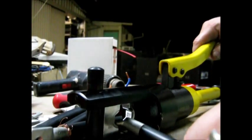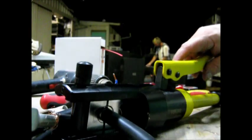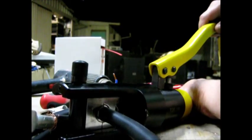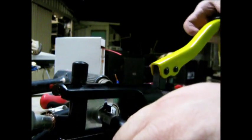We've got this big tool — put this in there and pump it. Make sure your terminals are the right way around; you don't want to get the terminals on upside down. You can see that, and basically you just take it all the way home. There you go — a double crimp.